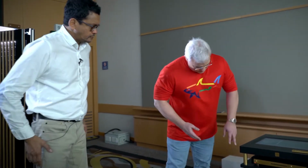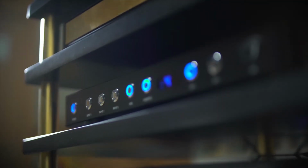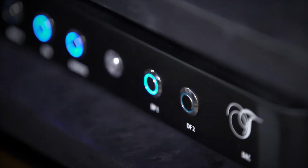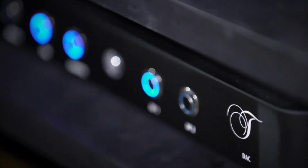We started with Black Devices, which is a reference line. We started maybe 10 years ago, and we used at that time the best electronics we could get. The idea behind Trinity is not to change too much, or actually not to change anything. So we do not add distortion, we do not add noise, we do not add hum. We do not remove things because the bandwidth is more than 500 kilohertz power bandwidth of the whole system.